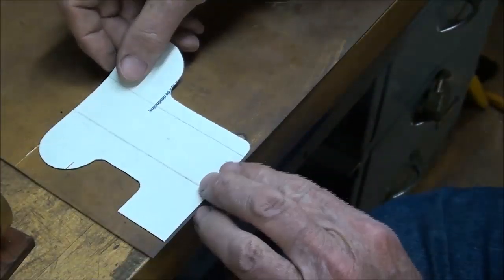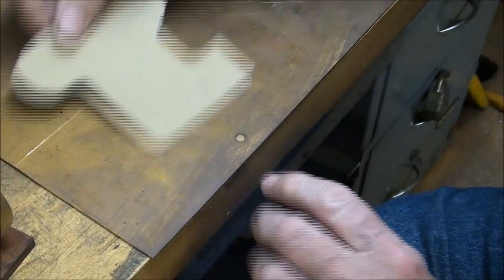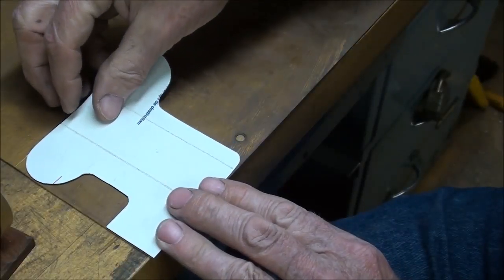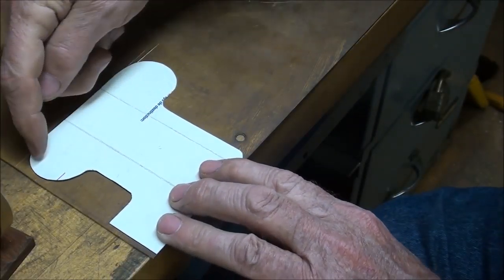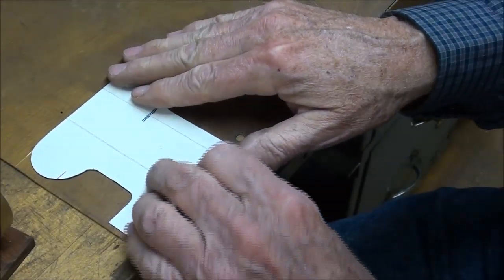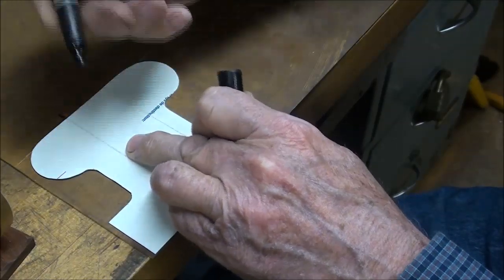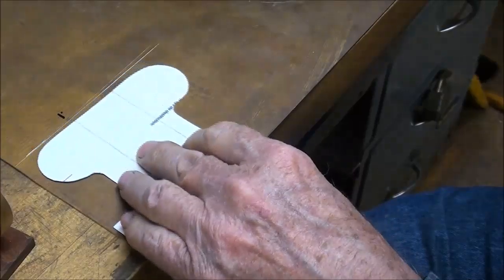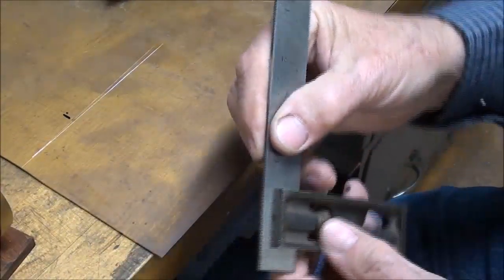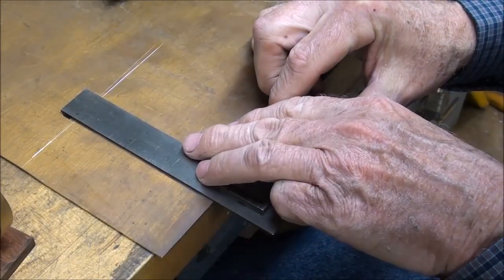Not the pine door, but boy, they really built those school buildings. So I'm, instead of doing it this way, where the hole's going to end up in here, I'm flipping it around like this. And I want to leave a little extra material. I'm a big one on leaving extra material and then taking it off later on. So to start with, use a marker too. They really work nice. I'm going to lay a line out with my square approximately on that black mark there.